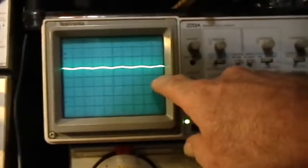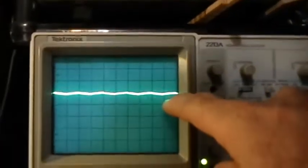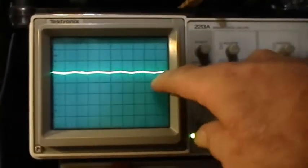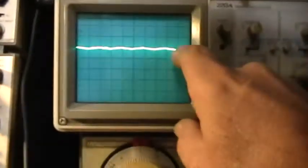Look what happened to the waveform — it's now feeding the internal circuitry of the power supply, and it has collapsed to a little under 5 volts, with a ripple-y profile. So we're dissipating power from the function generator inside the power supply, probably into its bleeder resistors.